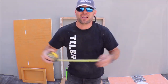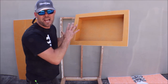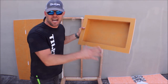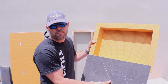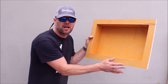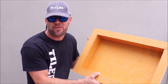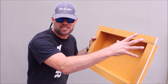How to measure and calculate the framing and placement of your shower niche so that full tiles start from the bottom of the shower pan or tub and end up right below where your sill will be installed. Pre-planning and measuring is key. Having a full tile at the bottom of the sill and a full tile at the top is aesthetically much more pleasing and simply looks better than having notched cut tile around the bottom and top corners.